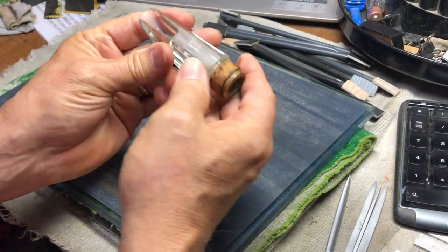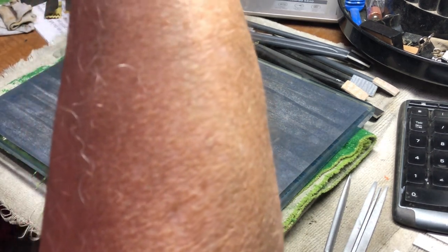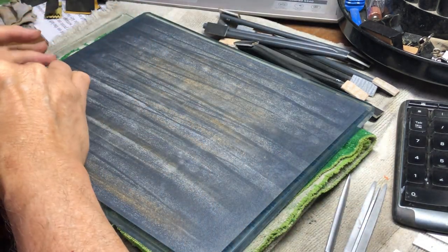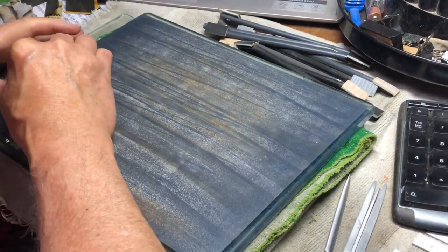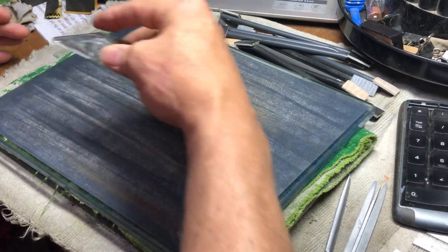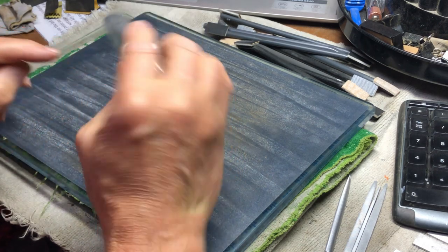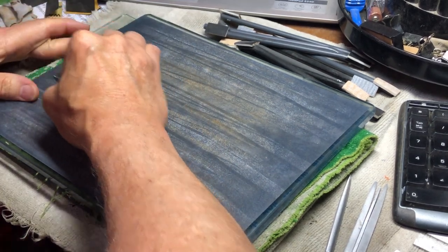The low spot in the middle is kind of nagging because it's hanging on there. I don't see a lot of light coming through, so maybe we'll get there. Now you see my hand technique. I do put extra pressure right here. And I am looking at whether or not I need to bias a little more to the left or the right to clean up this table.